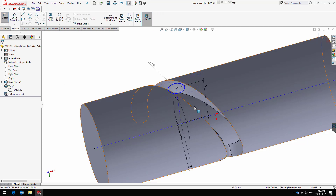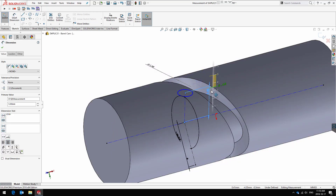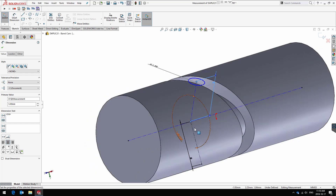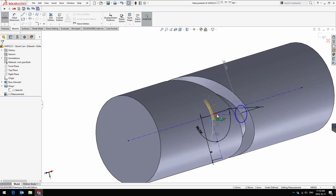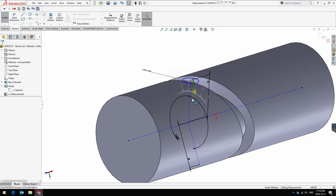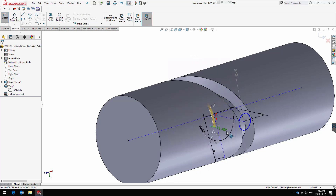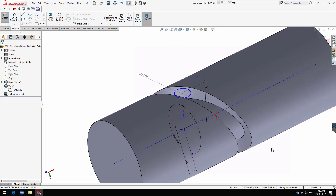The way I imagine this working is I will vary two values. One is going to be this 5mm depth for the probe, and the second one will be this angle from a known direction. When I select this angle, I can move it. As I'm moving it, the diameter of this circle is a driven dimension that provides me with the value. You can see how it varies — right now it's 199, it's supposed to be 200, and now it's 198 and 197 at one point. So obviously this is not the perfect cam.